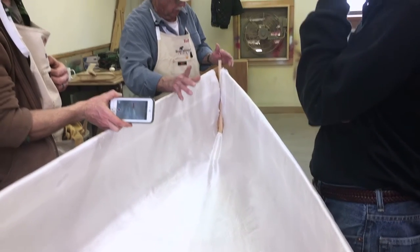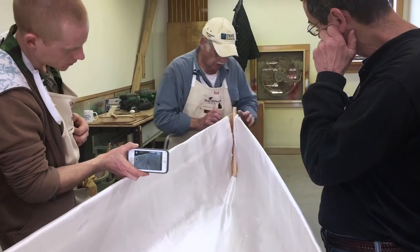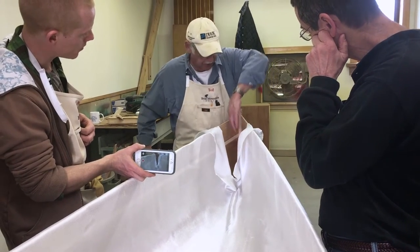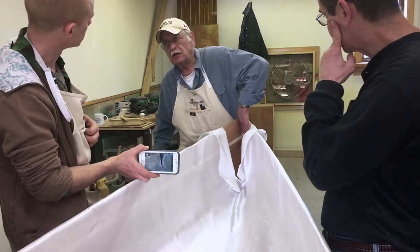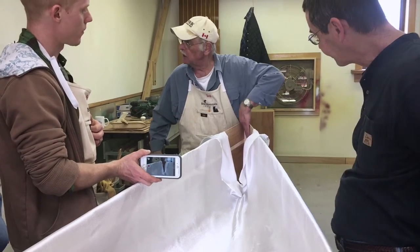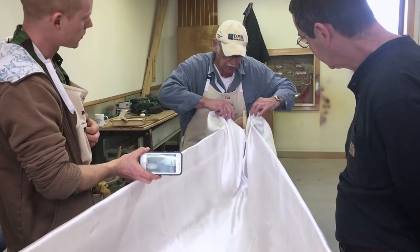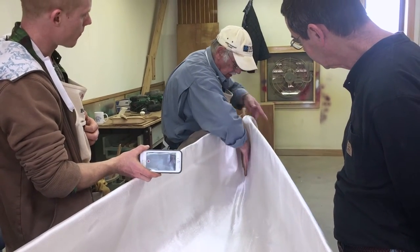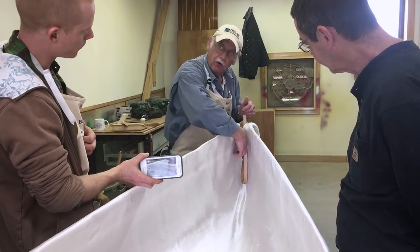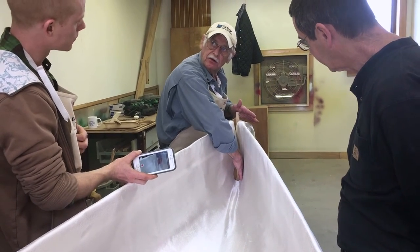So what I do, and it works really well, is to wet it out and stop about an inch short. And then fold that back, like that. And then coat up inside the end. You know, because we know we want to go all the way up. You don't want to brush over this cut edge to get up there. So then you would coat all that area, and then gently put this back in. And it will soak through from the bottom, so you won't have to add more. You just use your brush as a sponge to push it into the resin underneath.